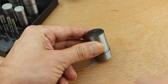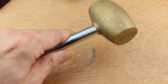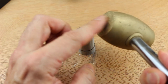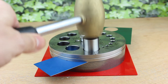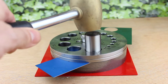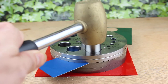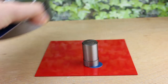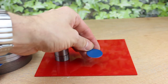As well as protecting the cutting surface, it's also important to protect the rest of the cutter too. I recommend using a two-pound brass mallet. This gives the weight you need to strike the punches and cut the material, but the brass will not dent or shatter the punches. Place the punch into the hole and strike vertically downwards with a solid, firm blow. For tough materials you might need to strike twice, but don't remove the punch — just keep it all still and strike it a second time. You'll know when it's cut because the punch will fall through the hole. Leave it there and just lift the whole unit up. You'll see the punch drop through, and your disc will be underneath it.